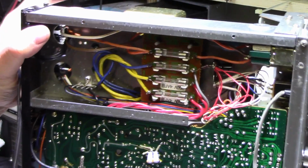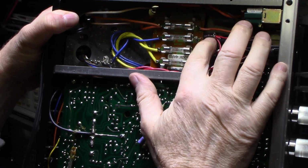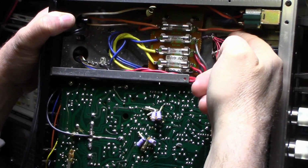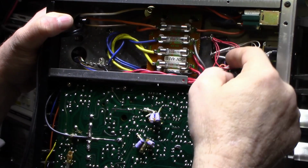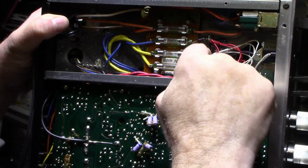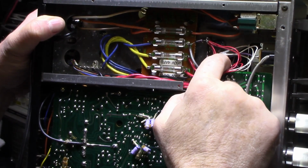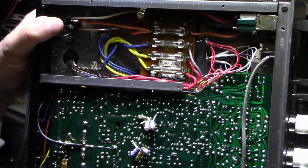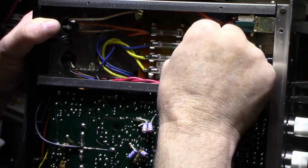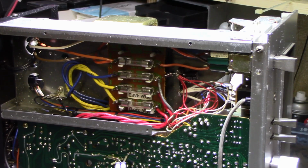If I can get some better light on this. There. Simple diode goes. I mounted a terminal strip here. It's grounded, and it's got a 100 microfarad cap, and that provides the smoothing for the LEDs. And then all the LEDs tie into this. The red's positive, the white is negative, and the negatives have the dropping resistors. There's 4 2.7K dropping resistors, and yeah, that's all there is to it. And everything's here. All right, so I'll put the bottom on and wrap this one up.